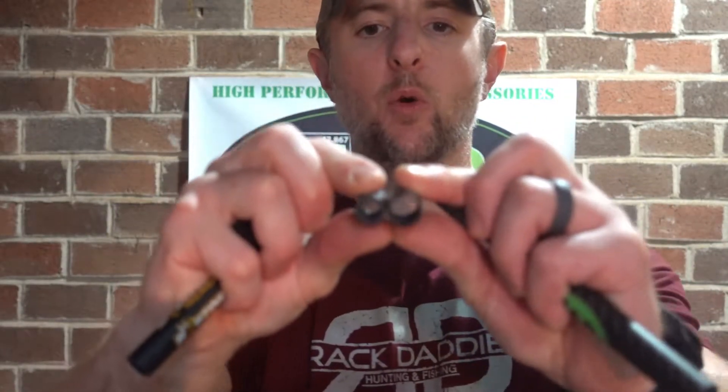Our wall thickness is sixty thousandths of an inch — considerably thinner. We also use a 3K weave, which is considered a high modulus carbon. People throw these terms around a lot in the industry, and many may not know what's being referred to. Ultimately, modulus refers to the modulus of elasticity — a higher modulus of elasticity means you have a more rigid product, more resistant to bending.